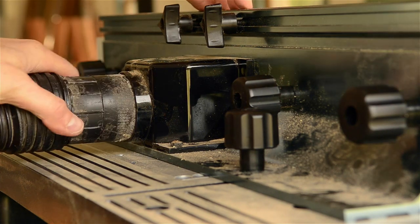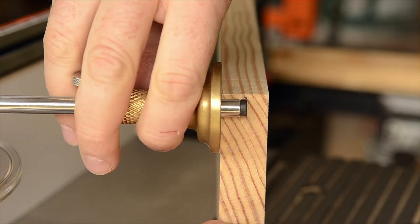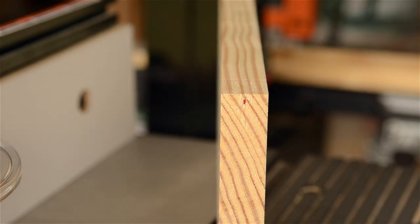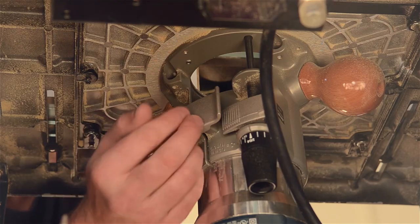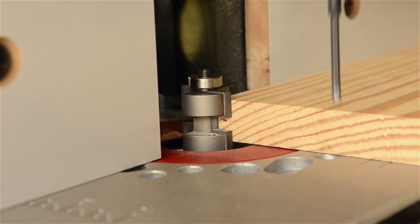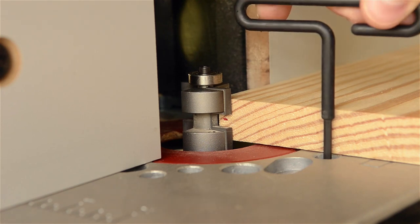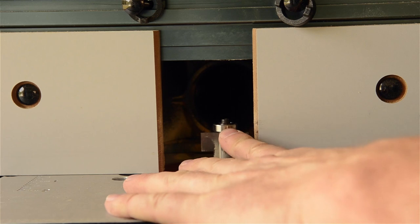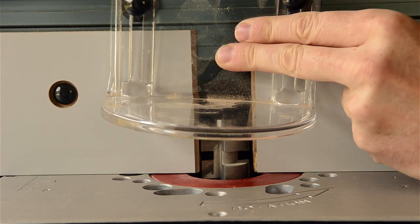Hook up the shop vac while you're back there. I like to use a marking gauge or a combination square to find the center of the board. I mark from each side of the board, and then the space right in the middle of the two gauge marks is the board's center. I mark it with a marker or a dark pencil. Then I place the board against the tongue router bit and use a micro adjuster to raise the bit. Adjust the router bit up or down until the marker line aligns in the center of the router bit's tongue opening. Move the fence facing so that there is minimal space on either side of the router bit for a cleaner cut. Attach any safety feature like a guard or a feather board, and always remember to use safety glasses and hearing protection.